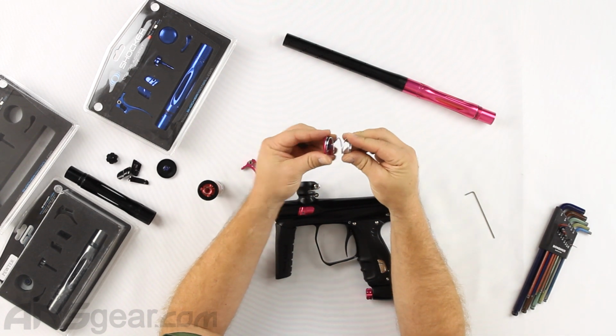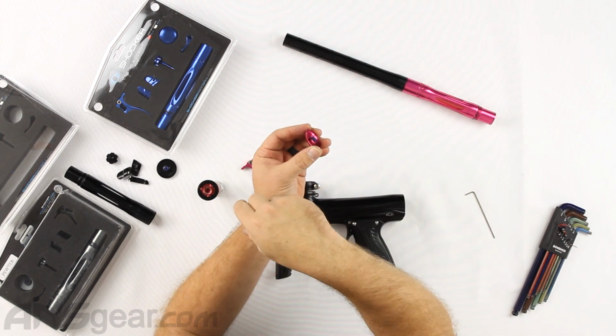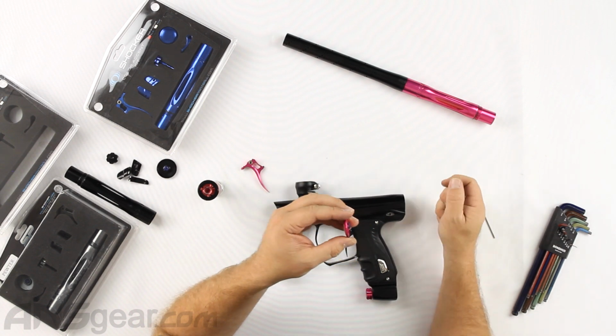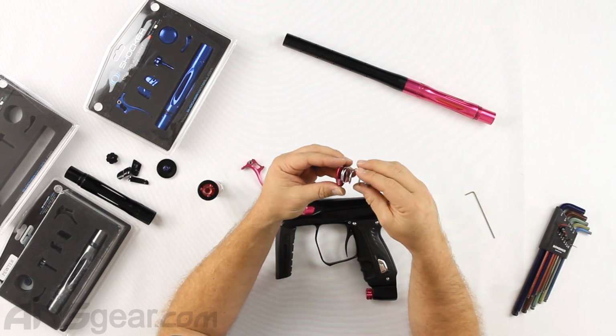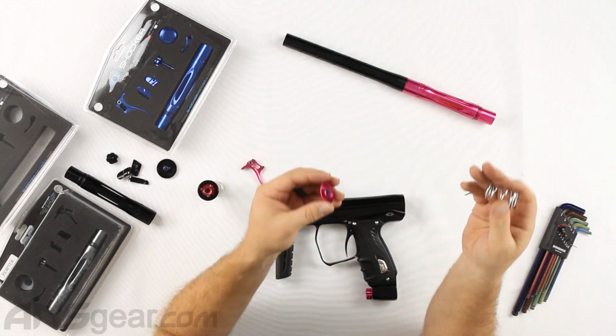It actually is perfectly designed to fit inside this groove. If you have it off center, when you try to thread it in, this will not thread all the way down, and it will compromise the working of the bolt. You want to make sure that you get it in. What will happen is it will leak. It won't snap together. If you try to gas it up, bad things are going to happen.